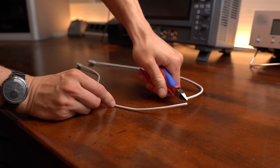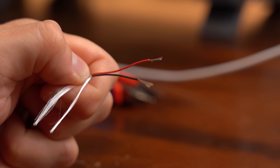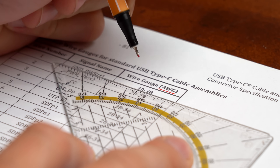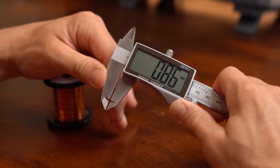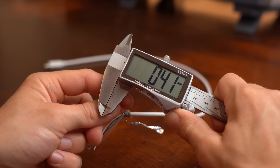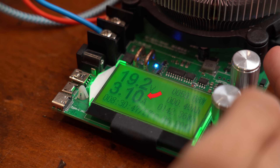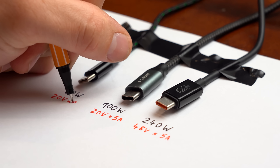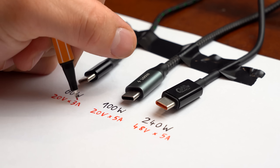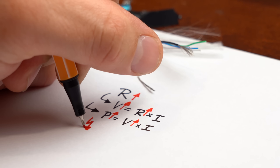This problem occurs because manufacturers sometimes use too thin power wires in their cables. The USB specification recommends 20 AWG, but sometimes you see much punier wires instead. That means a bigger resistance, and when the max current of 3A or 5A is flowing — depending on whether you have a 60W cable or a 100W/240W one — there will be a bigger voltage drop as well as more power losses.